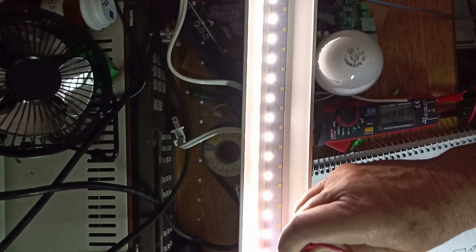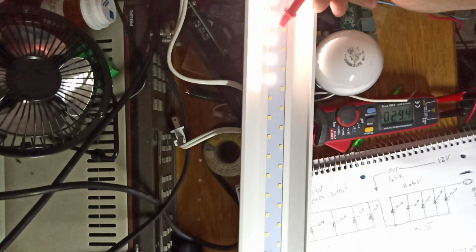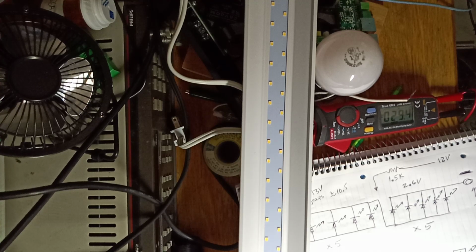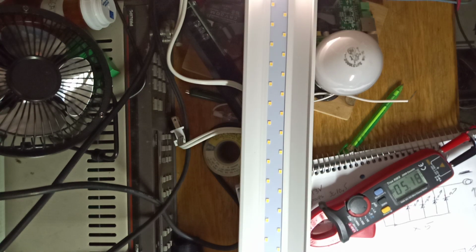And now I don't need any kind of converter or anything. It works on 12 volts. I can move it to someplace else where I'm working and just plug it right into my house, any outlet. So that's it. I just thought this was kind of interesting, this whole method of diagnosing it. And just having a probe with a resistor in series, because it takes very little to actually light an LED. Normally they'd be, see, this is two of them in series, that's 5 volts, 5.19. And that's at basically the Zener voltage. You can drive them a little bit harder, but if you reduce the amount of current into an LED, it's far more efficient. You just need more of them.